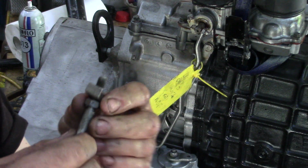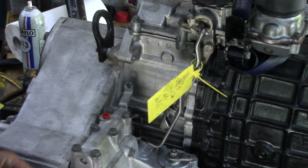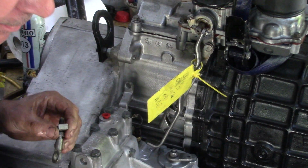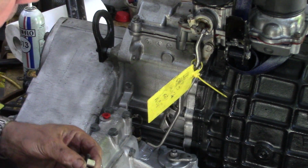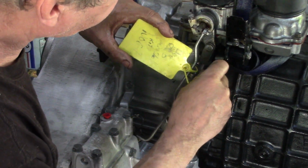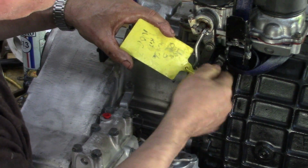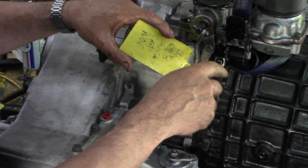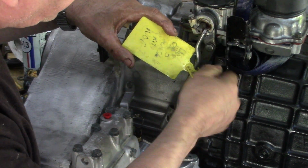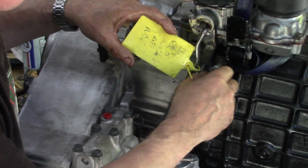So the next thing we're going to fit is this adjustable eye. It's wise to tap out the hole here and run a die nut down the thread, because you want this as free as possible, because it's going to make life so much easier. Now, there is supposed to be some clips to go on here to hold the breather pipes on, which we haven't got. But it's not the end of the world. You can always put a cable tie around them.